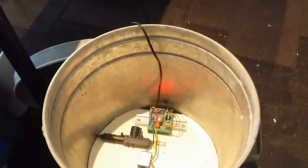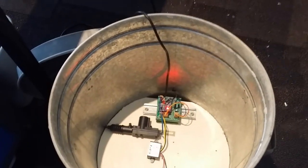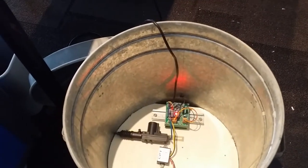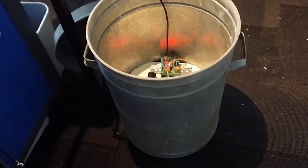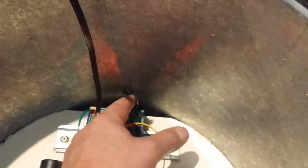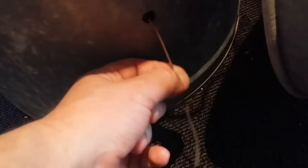I've rearranged the insides since to make the remote work better, because I had to be within about 2 or 3 metres of the can for it to trigger from the remote. The aerial was on the inside and it's a steel can, so the signal was doing well to get inside even from that distance. To fix it, I've drilled a hole in the side of the can and there's a little zip tie to make sure the cable can't get pulled through too much and rip it off the board. So that just goes onto the outside — it's just hanging out the back here, some brown wire so it's less obvious. You won't even really notice it at night time anyway, and that's the back of the prop.